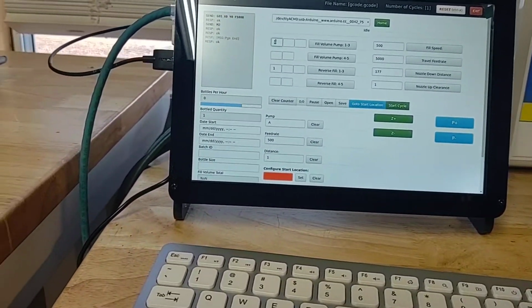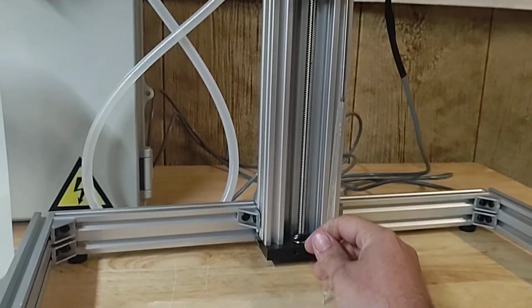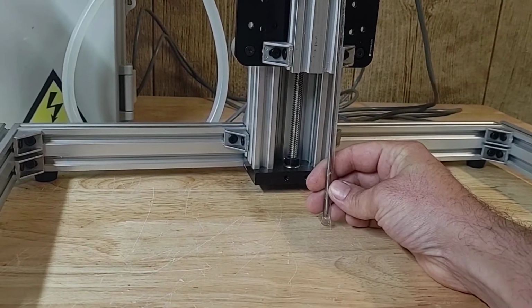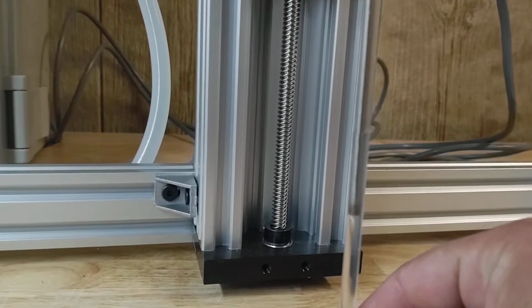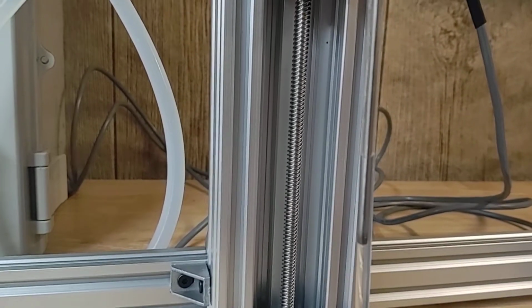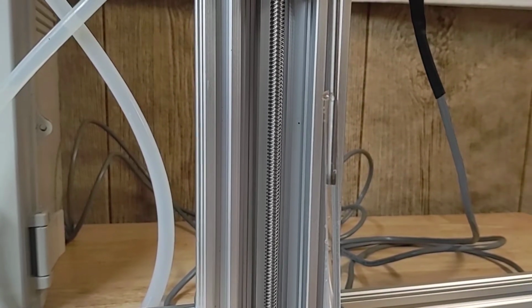Now we're going to overfill. So I'm going to put this guy to like 8. So I got a fill volume of 8. And I can actually use this foot pedal down here. That way I could hold this with my hand. So push the foot pedal. It's going to do my quick reverse fill, quick fill there at the beginning so there's no air pockets. And now you're going to see the water's kind of, it's way up here, way higher than the nozzle, which means it's going to overfill. And we don't want that either, especially when we are dealing with honey.